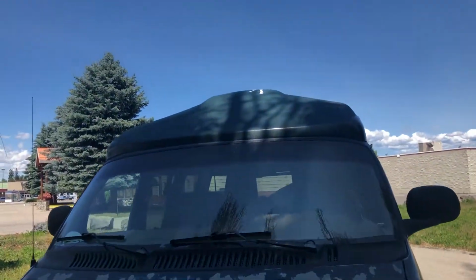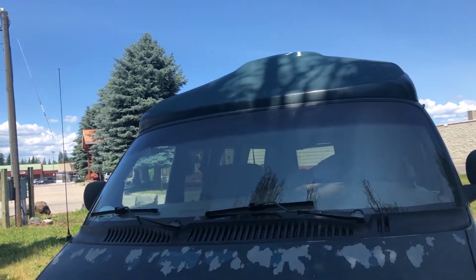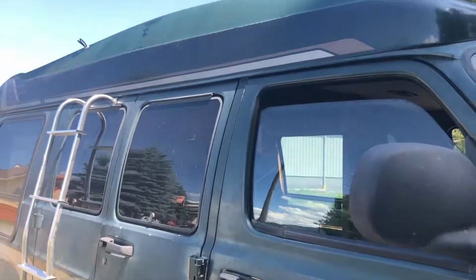The other big thing I gotta do today is seal in the leak that's happening right up there. It's a lot less water than before when it leaked again, but that's where the solar panels are. You can't really see because it's so high, but under there, something with the little L brackets that are used to keep them on. I can't get under them because of how we put the solar panels so close together. So I need to put some sealant on my finger and then just kind of run it under that because I can't get the whole gun under there.